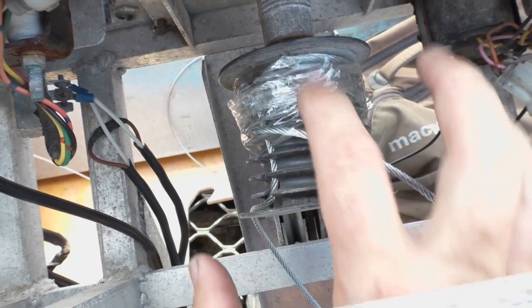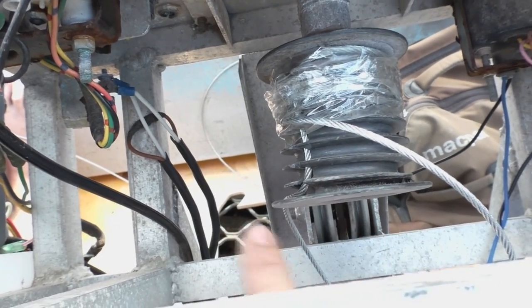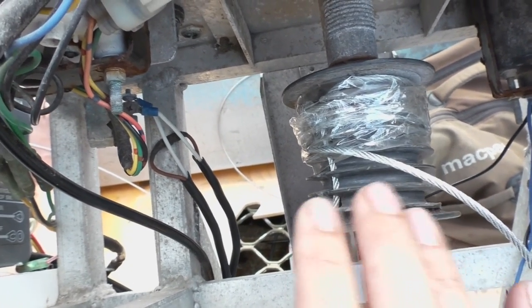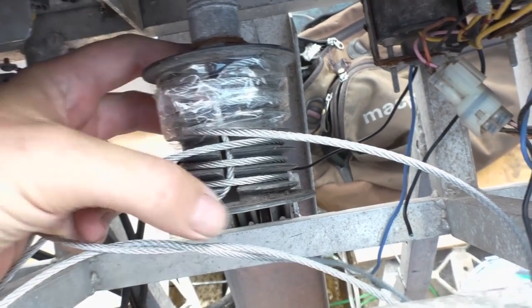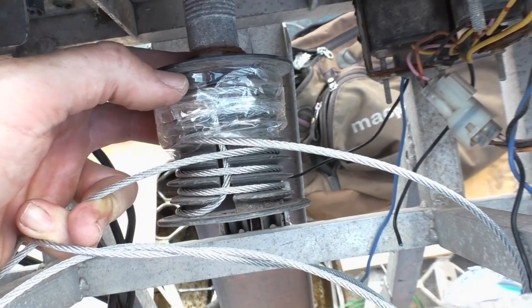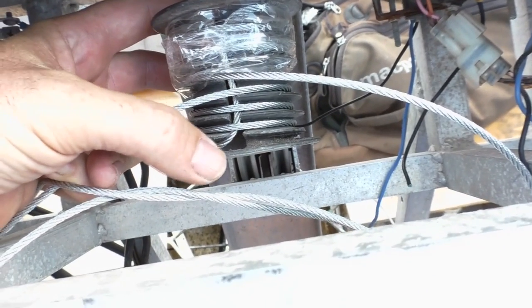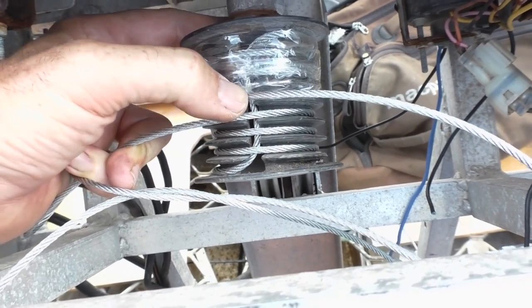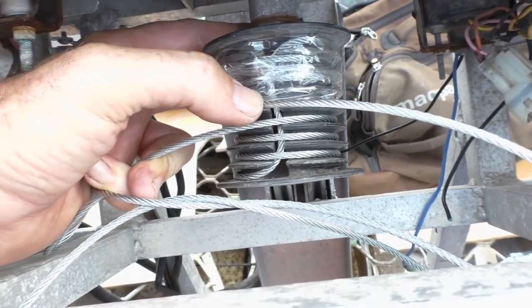Now I've got this cable wound onto the aft half of the drum, I'm going to just wind this forward half on by hand. I can do that here because I've got access to the end of the drum, so I can actually just spiral it around. Once I've done that, I'll tape it up on both sides and then we're ready to run the cables around to the back. What you should end up with is the very centre of the cable going through that longitudinal groove, then at the back it's wound around until the cable heads off from the top to the port side. The forward part is wound round as well, meets in the middle, and heads off to the other side of the boat — both cables meeting in the middle and heading off to the opposite sides.